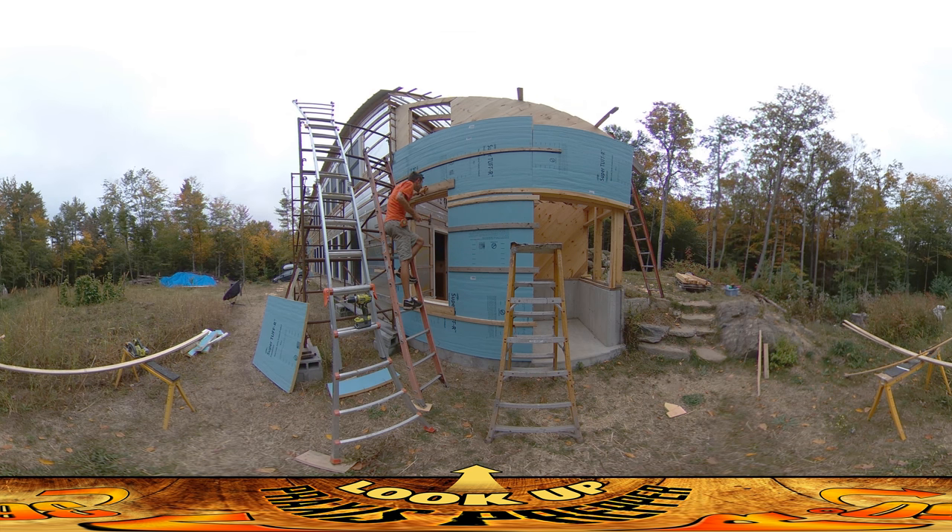Alright, it looks about level with the inside framing of the window — I can always tweak this around later. Get it into the foam, into the wood a little, moving the other side. It's kind of satisfying nailing through the foam because it's so easy. Now we'll drop this in. Not even a hint of any cracking going on there. If I had done it in the cracked spot, I'm absolutely certain that would have cracked out, but here it worked out just fine.